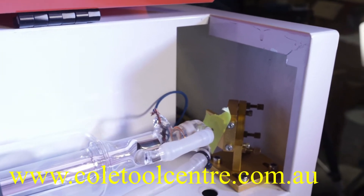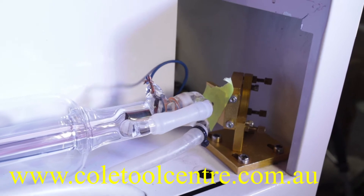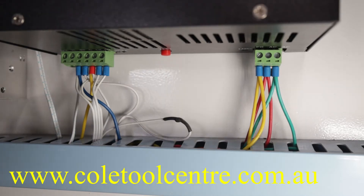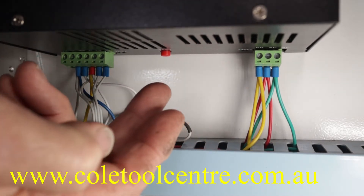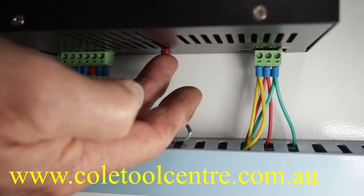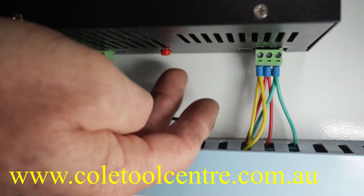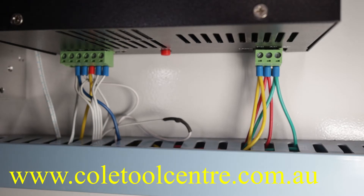You can use a multimeter, or you can bypass the lockout circuit if you don't have one. Looking at the laser power supply, in the center there's a little red test button which fires the laser tube regardless of whether the lockout switches are working. If the lockout switches are locking it out, it won't fire normally, but pressing that test button should show a LED. You should see a red light indicating it's firing correctly, which confirms the power supply itself is functioning.